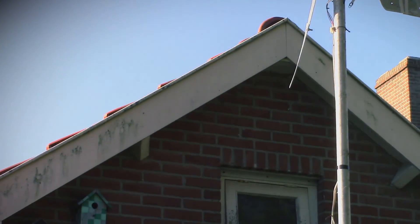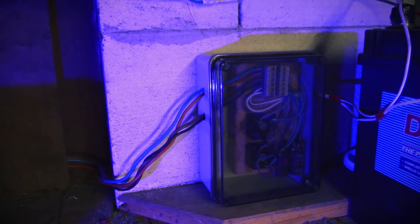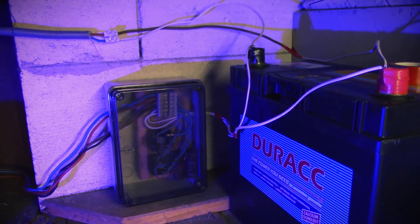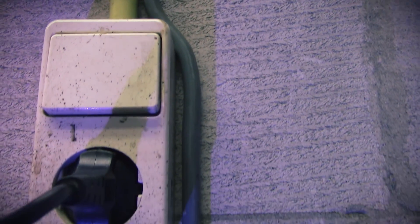The generator outputs two-phase AC electricity, which goes through some wires into the loft of the nearby shed. Here it goes into a two-phase rectifier, which rectifies it into DC power that is fed directly into a car battery. The DC output from the rectifier is somewhere between 10 to 20 volts, which is a very nice voltage for charging car batteries, so I don't need any additional charging circuitry. The car battery is the storage system, and from it a cable runs down into the shed where I have a 12-volt output I can use to power things.